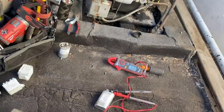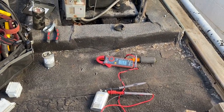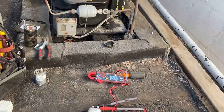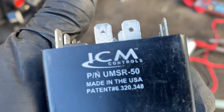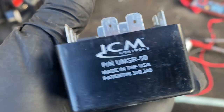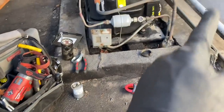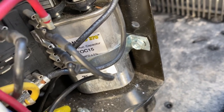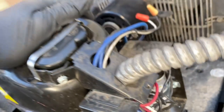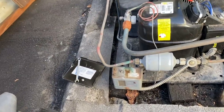I also brought up a plethora of potential relays. I want to change that potential relay out too. There are just so many variations — I don't know what part number for the ultimate backup. I do have this ICM Universal, just in case. Hopefully one of these Copeland ones will be the same part number. Here's where we're at: we got the new run cap in, I was able to use the original bracket. I ended up going with the universal relay — I didn't have one with the same number.